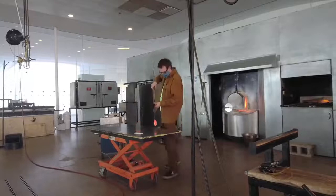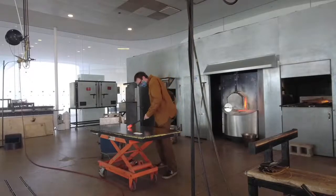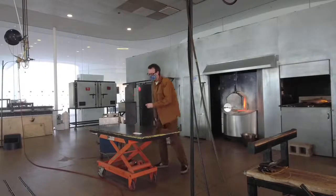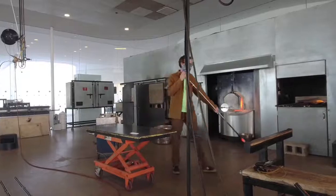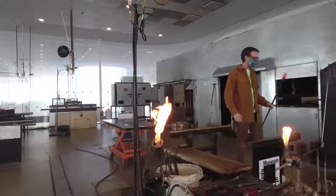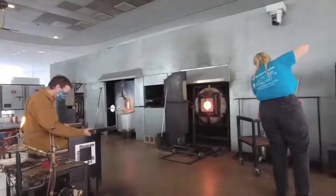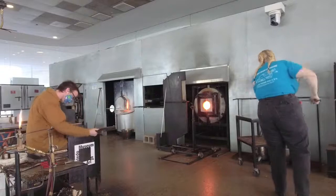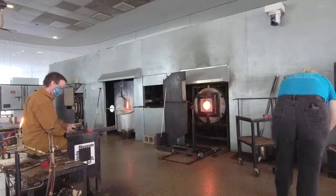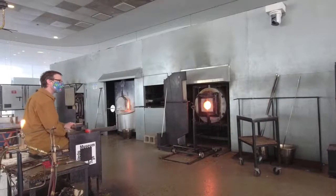I'm going to take this bar away from Colin. And Sandy's going to shape that bubble up. So we're going to do what's called the color drop. And we're basically going to drop this little chunk of bar that I've got on top of Sandy's bubble, and we're going to encase this color in. Our furnace is entirely colorless, so all of that glass is totally clear.